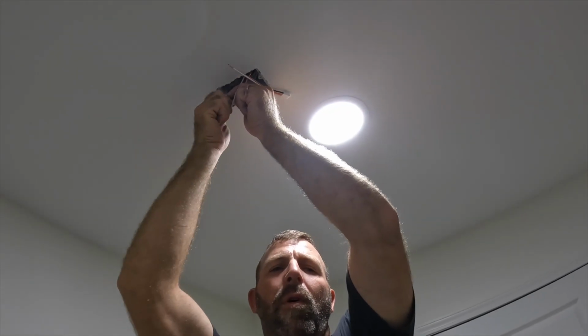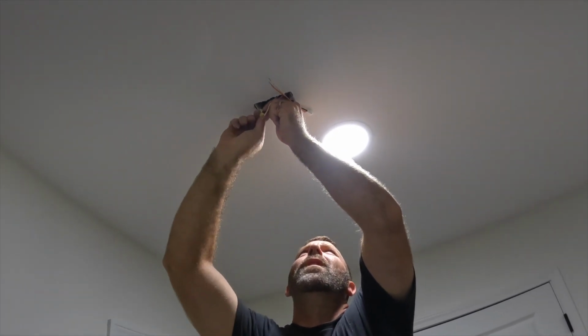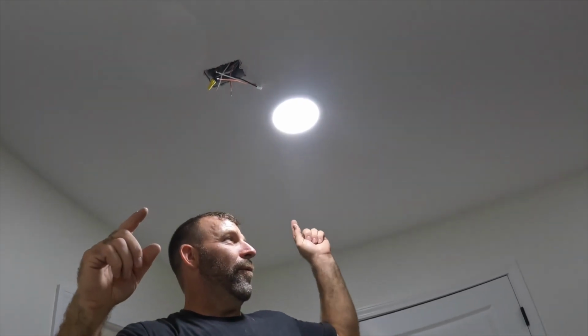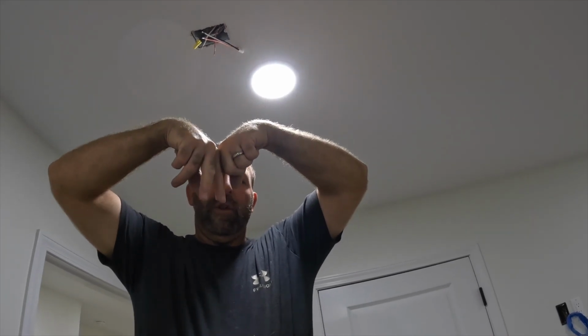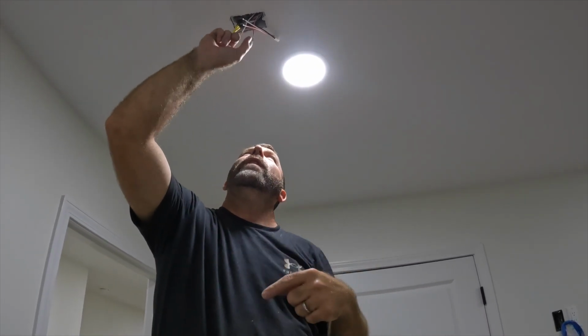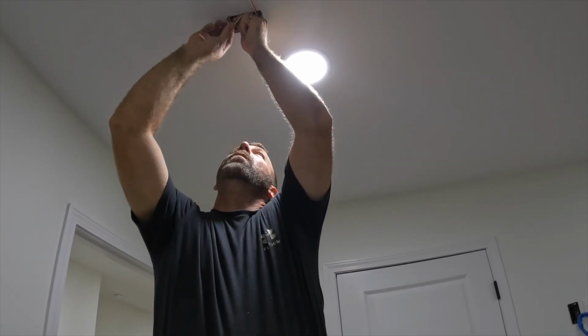And we prepped all these during the electrical portion. When we inserted the boxes and ran the wires, see all this stuff sewn together up here? Each wire that ran from one smoke alarm to the next ended up getting split and sewn together with one tail wire coming out. And that's what these are, so that we only add one to the smoke detector.